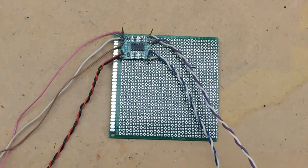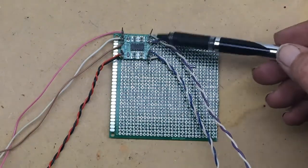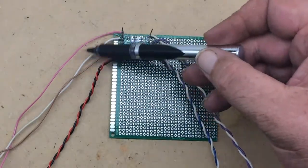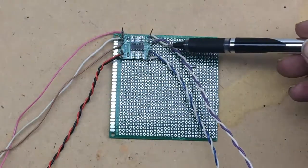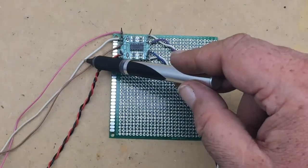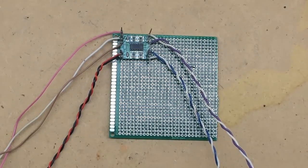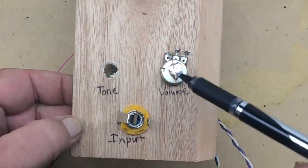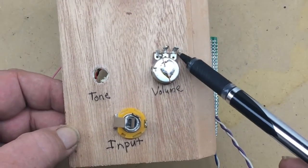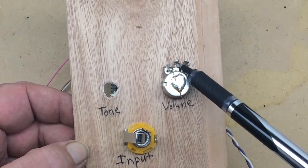Okay guys, I got all the leads put on this. Here is our speakers out left and right. Red and black is the power, and here we have our input. All audio grounds are white, whether that's going to the speaker or incoming. Next up, we're going to hook up our volume pot. To make a volume pot, we ground the left lug back. The input will be the right lug, and the output will be the center lug.